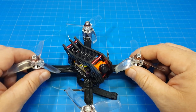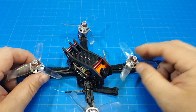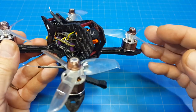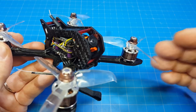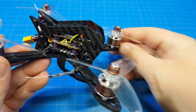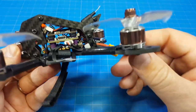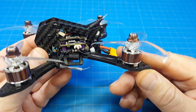I think this is a good machine. It comes in at $139 and you can get it from Hobbywing.com — you might even find it on Amazon, and I'll put a link in the description below. It's just got that issue with the camera angle. For many people that might not be an issue, because a lot of even pro pilots don't fly with a lot of camera angle. The maximum camera angle you can get is about 30 to 35 degrees, and that's the max without doing more than what I've already done.